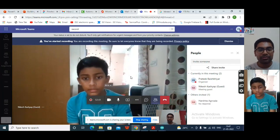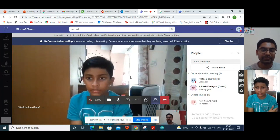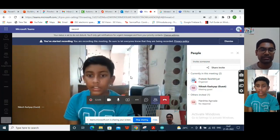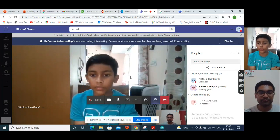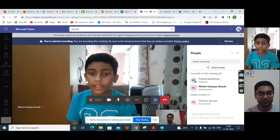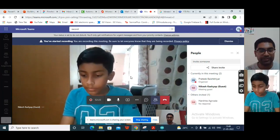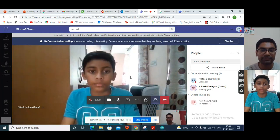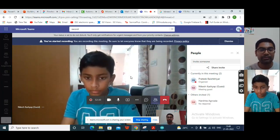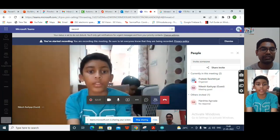And one more thing. We have used high and low here, so what is the meaning of high and low in terms of this programming? It will give higher power, more voltage to the pin, and low means it will give low voltage to the pin. Exactly. What you are saying is very correct. To be more apt, I will explain. High, in our context, is 5 volt. It will give 5 volt to the pin, and low will give 0 volt to the pin. So using 5 volt and 0 volt, we are able to control various devices.